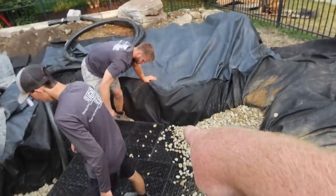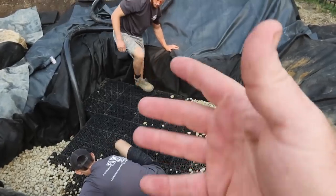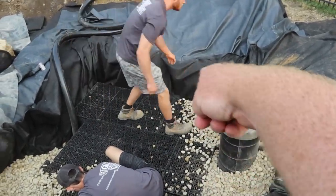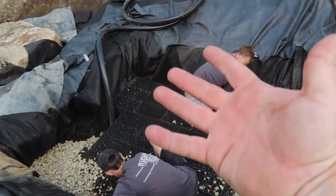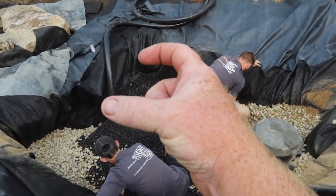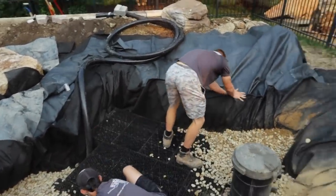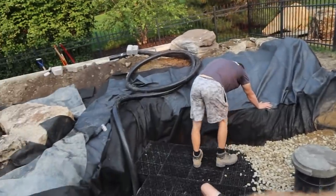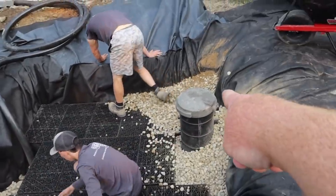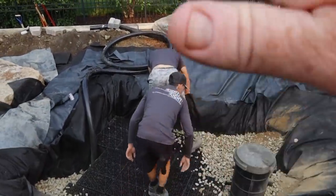You can see the aqua blocks in place. They backfilled the joints, and they're going to backfill the areas where Corey's foot went in with some gravel. I really want to force the water to take the path of least resistance — if we didn't backfill those areas, water would come up around the channels. We want everything to come up through the aqua blocks. As it comes up, it'll hit another layer of aggregate — about two to three inch pieces — and as we get higher, the aggregate gets smaller. This is a good time to rinse it in layers, move that stuff toward the centipede, pop the lid and pump out the dirty water.